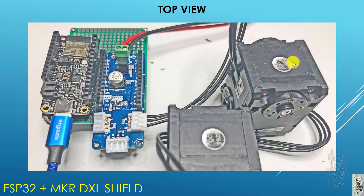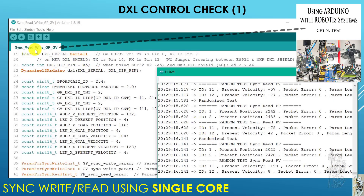For my test I'm using two 2XL430 servos. ID 1 and 2 are used for goal position or position control mode, and ID 11 and 12 are used for velocity control mode. For my book, I documented this code — sync write and sync read — very well.